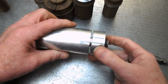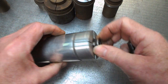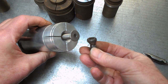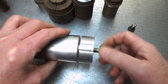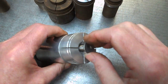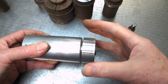Slight variation - this was something that I made using the same sort of principle. Wonky saw cuts, and I just used a countersink bolt here - just a standard 90 degrees. That doesn't actually work as well as a 60-degree one, so this is better. But this wasn't actually for turning - this was just to hold a very thin sheet metal pressing that I needed to hold to polish across the top. Same sort of thing: put your piece on there, do the bolt up, that expands and holds your part.